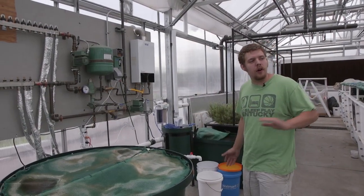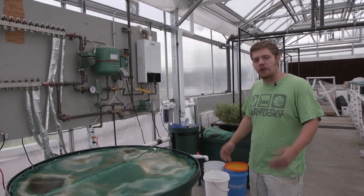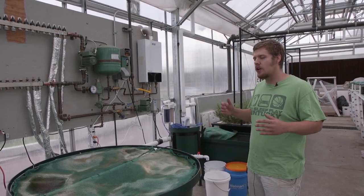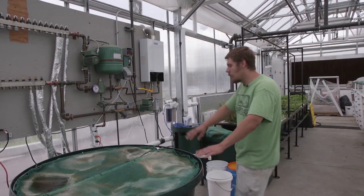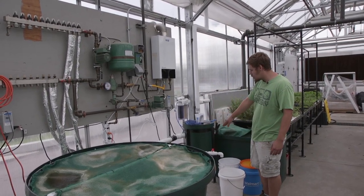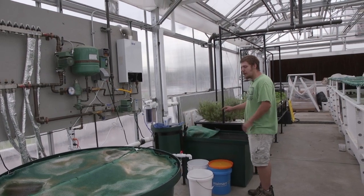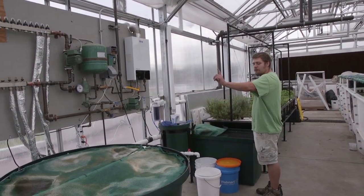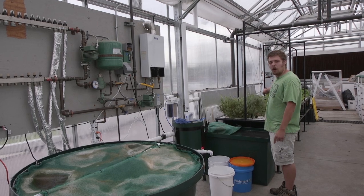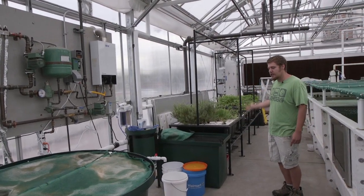This is a small system that's a part of the farm but separate. A lot of aquaponics producers like flexibility in what they're growing, so this gives farmers the ability to test out new crops or experiment. Here we have our fish tank. From here, the water flows into a swirl filter where a portion of the solids settle to the bottom and are discharged daily. The clean water then flows into the sump. From the sump it is pumped in two directions — the majority goes back to the fish tank for good water exchange, and a small amount goes to the plants. It feeds all the way through the plant beds and back into the sump, where water is continuously recirculated.